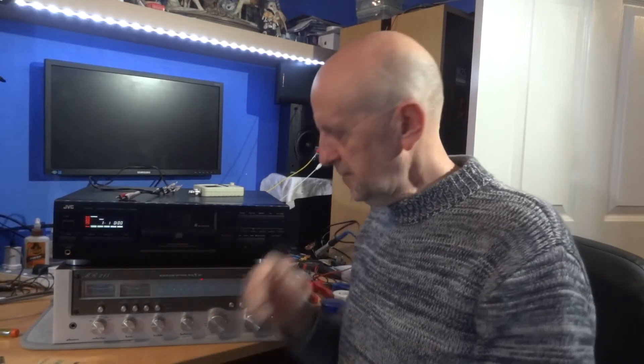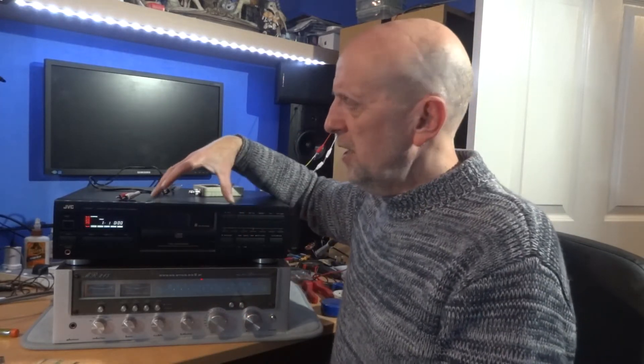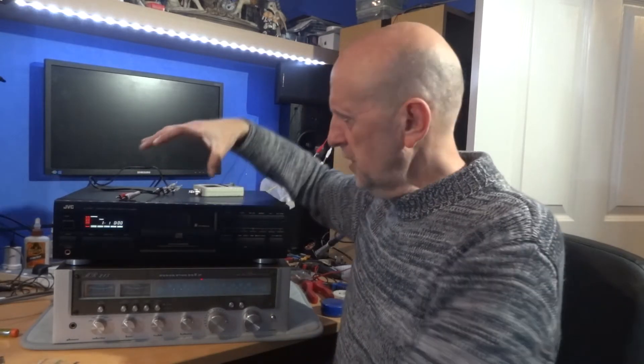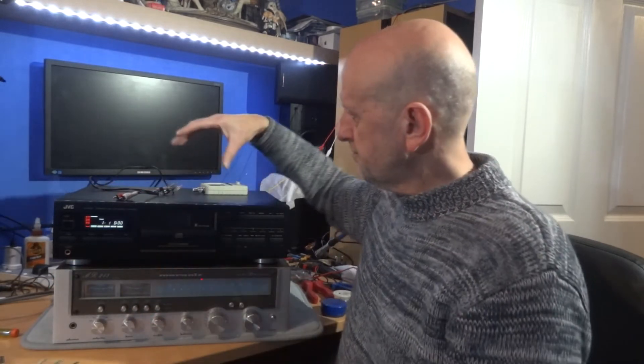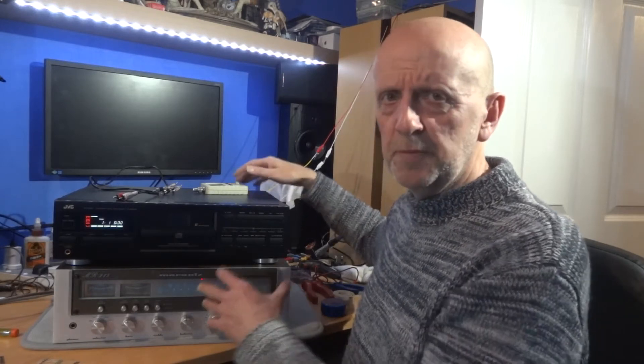Before I started my channel I got all my bits and pieces together. I thought I'd do a channel on audio because I can do a little bit of tinkering around as well, try and make it my own. I knew I needed to get a phono lead with an attenuator in it because all these old amps - and I'd read up about it - they probably need attenuation because the output of these CD players is too high on most occasions. So the sound coming out of the phono sockets into your amplifier or preamp is too loud.